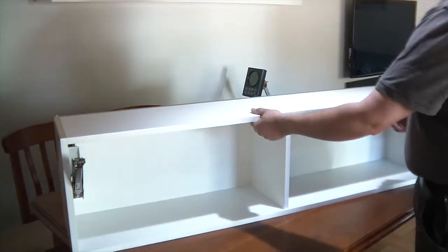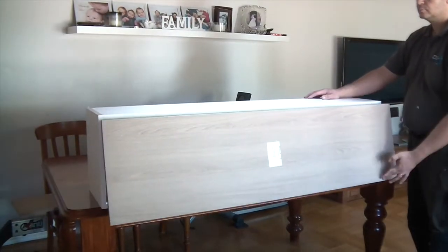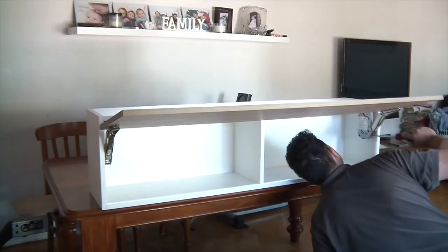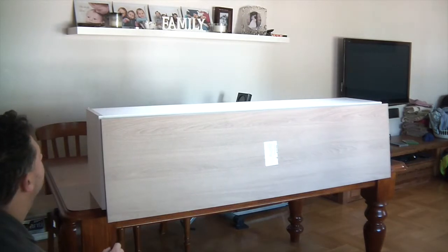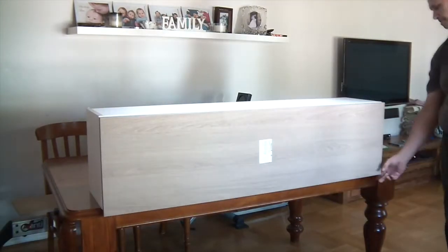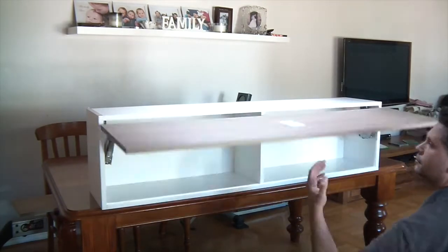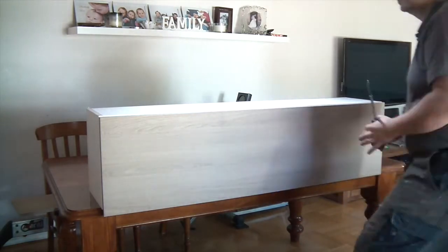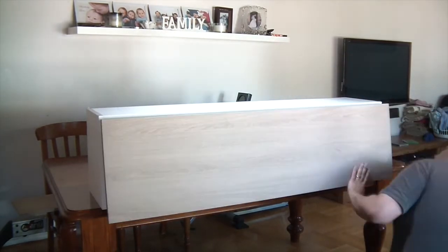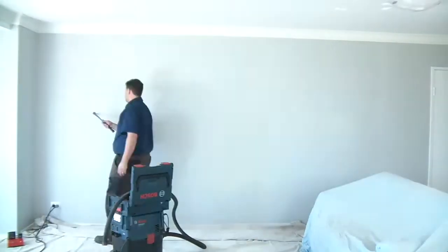Here's the first completed box. These Hafele lift stays are really nice — soft close and automatic open — and they're the same price as the garbage you can buy from Bunnings, but they have a great deal more adjustment, neat cover caps that hide the mechanical parts, and they're made in Belgium, not China. You can adjust up, down, skew, side to side, in and out, how slowly it closes and how quickly it opens. That board is Egger Feelwood in Sand Orleans Oak — this is a beachside property and the weathered oak sandy color works really nicely. Egger Feelwood is textured as well as colored and printed, so it's really one of the best non-timber veneers I've seen.